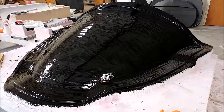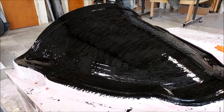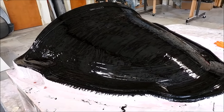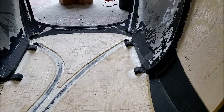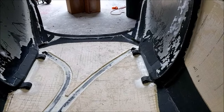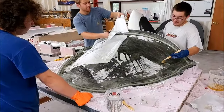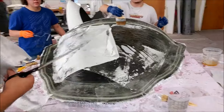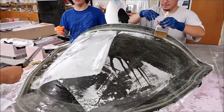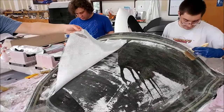Meanwhile, the other guys were laying up the mold for the nose compartment door. Here it is with two coats of black top coat put on before they lay the fiberglass. You can see the parachute strap channels being laid up with a mixture of resin and flox, filling those in nicely before putting the last bit of quarter-inch core in. They also patched around the door and hinges and laid the glass down for this mold — they seem quite proficient now and got it done without too much hassle.